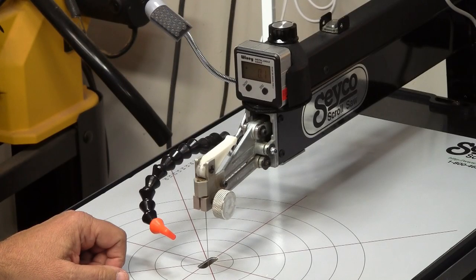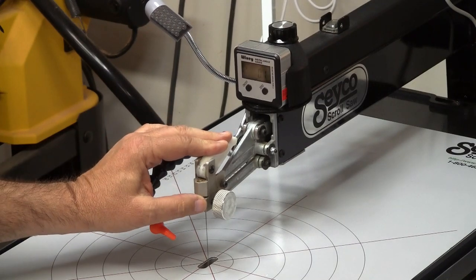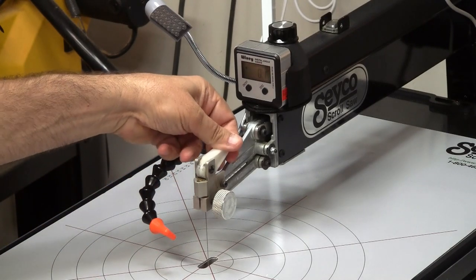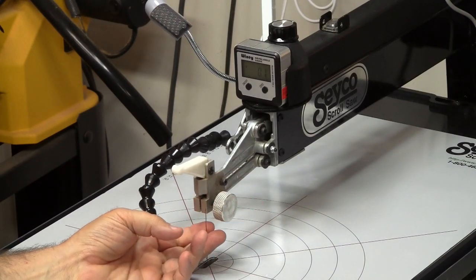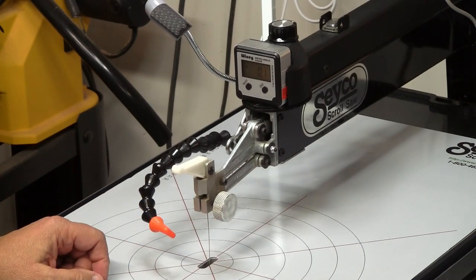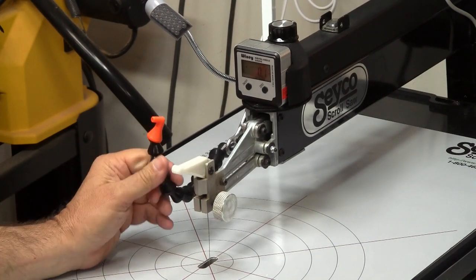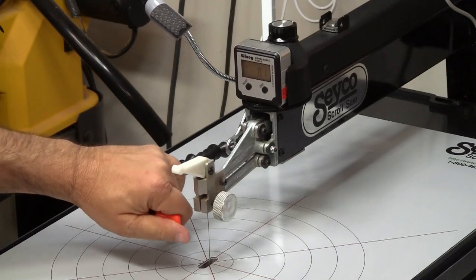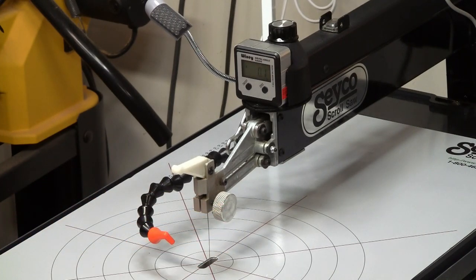Let's look at the front of the machine. For those familiar with the DeWalt, Delta, Excalibur, or Jet, you'll recognize the clamp style — it's a single lever to release the tension and a thumb screw to release the blade, so that'll be familiar to many of you. It also comes with a dust blower that has a 90-degree bend on it and is a little longer than standard, which allows you to get the dust blower out in front of the blade with the air pushing sawdust towards the back of the machine instead of into your lap.